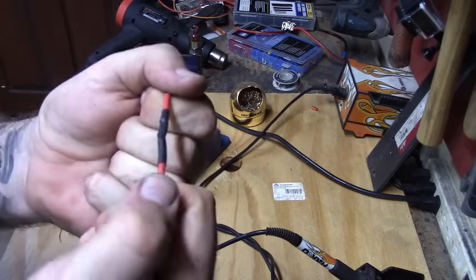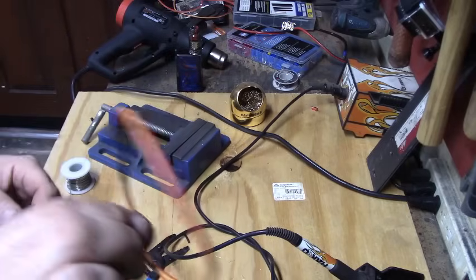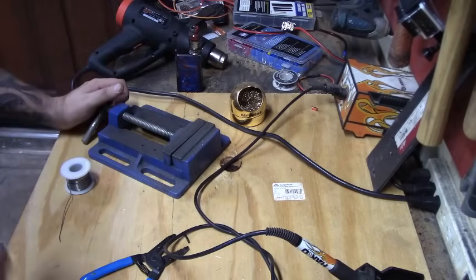That's how we want our wires in the car — so they don't come loose and won't break on us. Whenever you're running a power wire to anything it should be fused — a fuse or breaker inline — in case there's a short. The fuse will blow before anything goes wrong, breaking the circuit on the hot wire so you don't have a meltdown in the car.